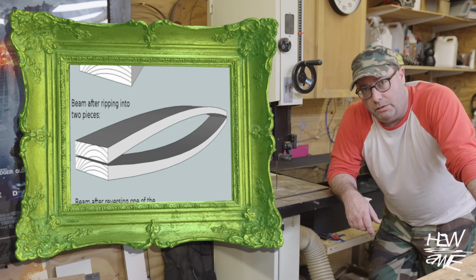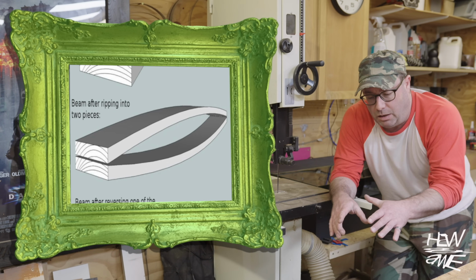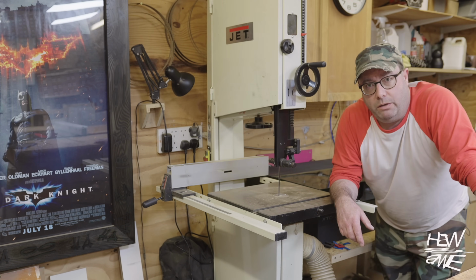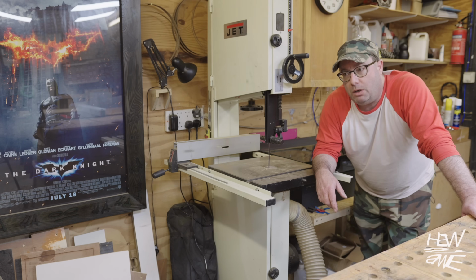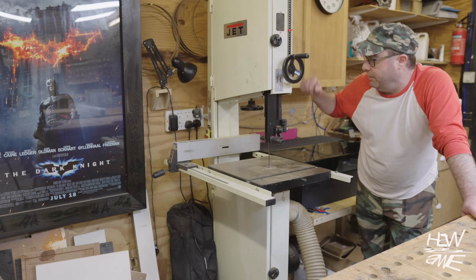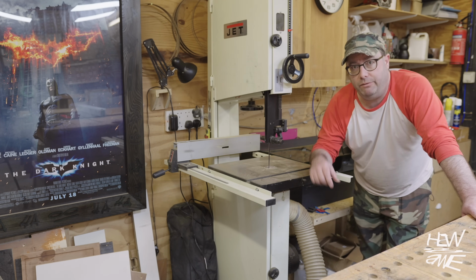The trouble with resawing boards is you can often release a lot of tension in the board, so you could cut boards straight like that, but it opens up like that. Then you've got to plane the thickness down to get the 2 sides parallel, which can result in nothing left of the board or even less thickness than you're after. What I would like in a different brand of saw is a speed setting so I could cut metal with it. Also, this doesn't have a tension release lever, which would be nice, and I'm forever walking away from the bandsaw and not relieving the tension on it.